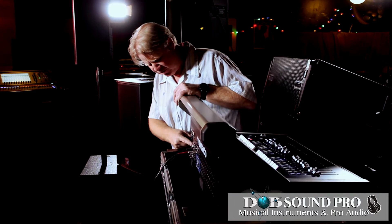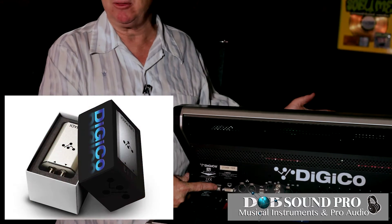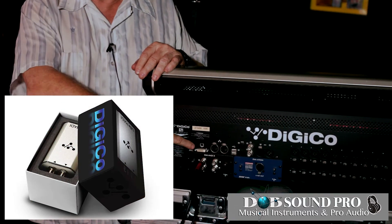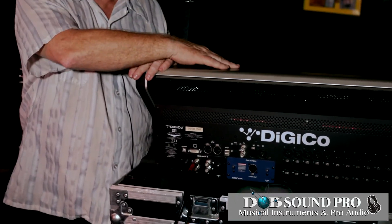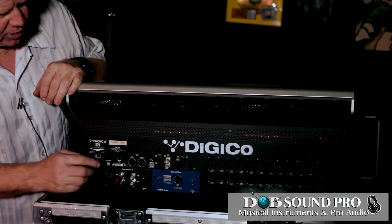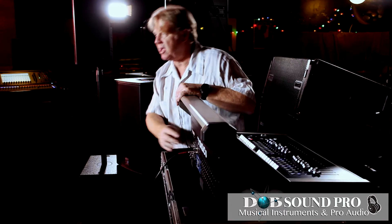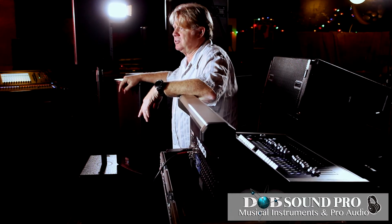You may have a Dante recorder, an AES recorder, or a MADI recorder — it'll do any of that. The UB MADI is a 48-channel recorder that comes up on the front of the screen and basically allows you to automatically record any channels coming into the desk onto your laptop or stationary computer, then brings it right back in. On the back panel you have your 24 inputs and 12 outputs native to it, a couple of AES, a word clock, a GPI/GPO which lets you add a footswitch — so if you want tap delay on your foot, you can do that.